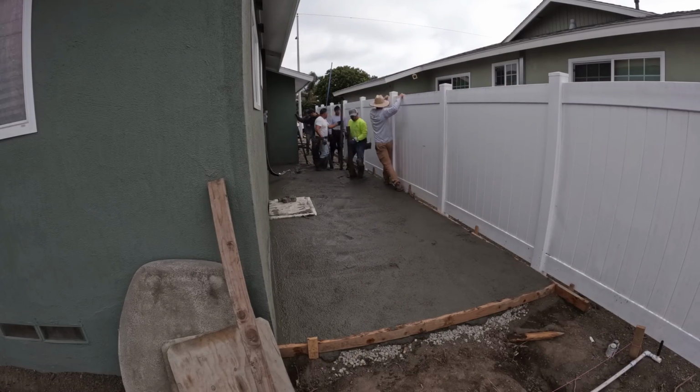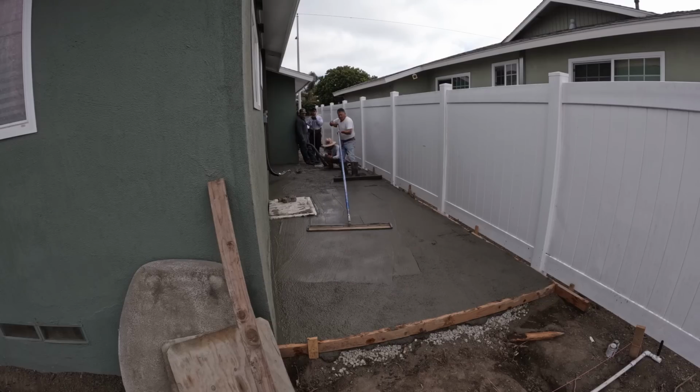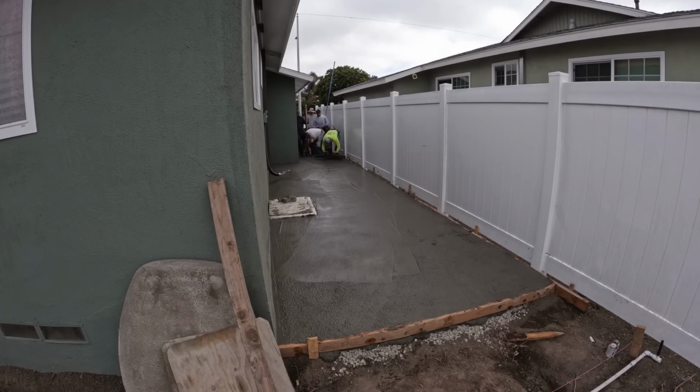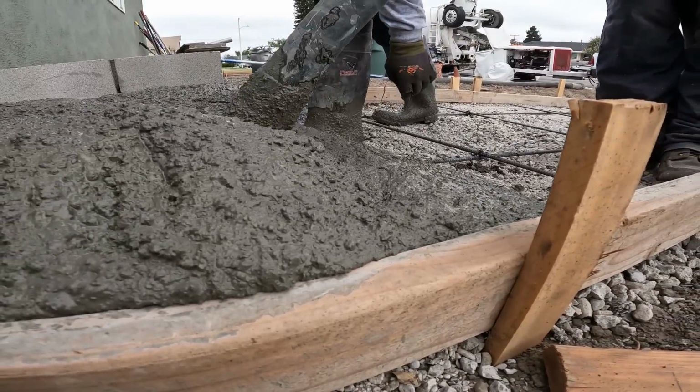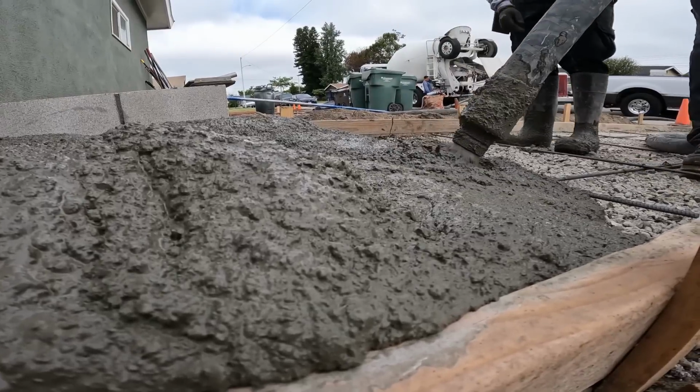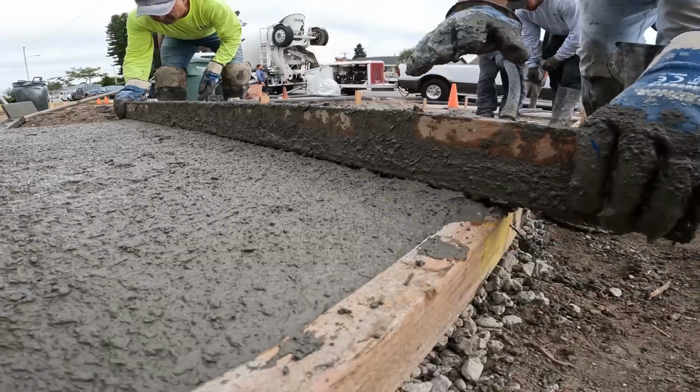The reason you don't use dobies in these situations, there's quite a few reasons actually, but one of them is because the concrete's pretty thin to begin with, and if you use a dobie, it's too close to the surface, which means it could get water into it from the surface and it could crack the concrete. The other problem is if it's on dobies and everybody's walking through here and you got hoses on it, it's going to get bent. So now it's uneven, so you have places that are at the surface, places that are at the dirt. This way when it's on the ground, it stays straight and you can pull it up evenly, and then you just step in. As you can see, there's 2 feet in between the bars. So this works out really nicely this way.